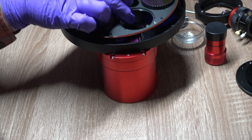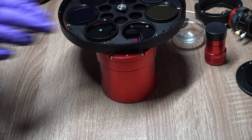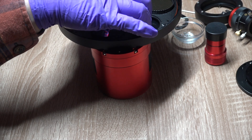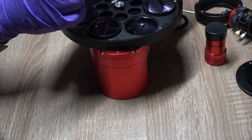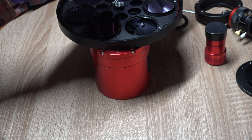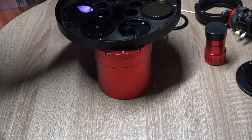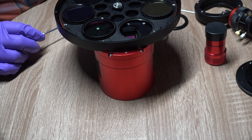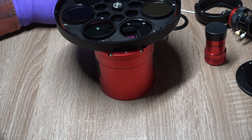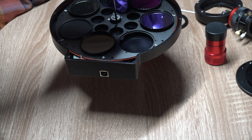To replace the filter wheel, we actually have to lift up a small rubber catch which protects the wheel from falling off, then place it down, align the screw holes, and replace the screws we removed earlier. This is best done with forceps. It doesn't really matter what the orientation of the wheel is — there is a sensor on each numbered cell, and when we power up the unit it will calibrate and reestablish the zero point of the filters. So there's no need to worry about lining the wheel up right now. We tighten them down snugly but don't over-torque them.